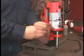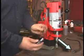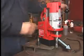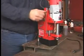Always inspect your cutters. If they're dull, take them to a professional resharpening service. These cutters look good. Keep the shank free of oil and dirt — foreign material can cause misalignment and excessive drill run-out. Always unplug the tool before making changes or adjustments.